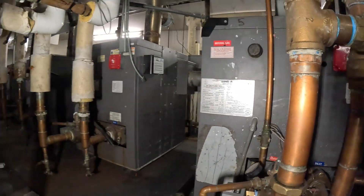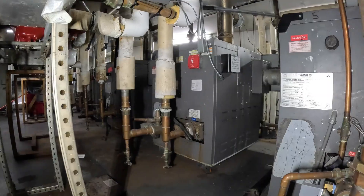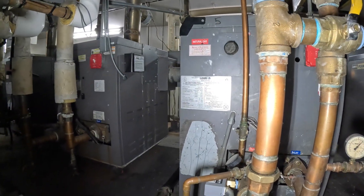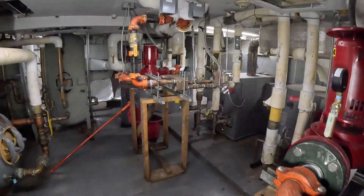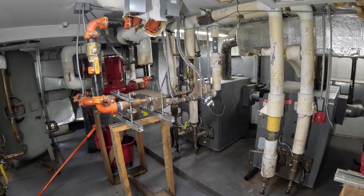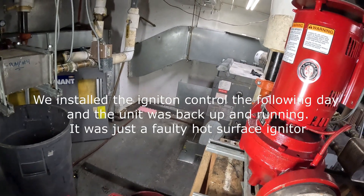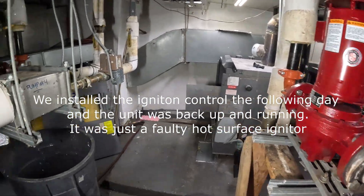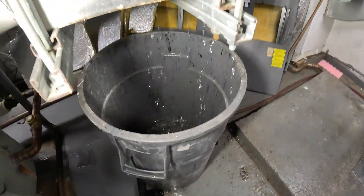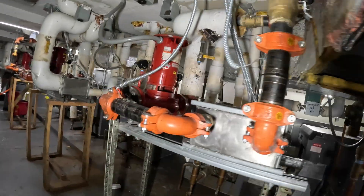They're actually getting rid of all these boilers — it looks like they're going to go with electric boilers, getting rid of gas equipment out here in New York City. For this one we had a bad ignition control — pulled it off the other one, put it in here, everything's working. The other one: the ignition control was sending 120 volts but we weren't pulling amps — bad hot surface igniter. That one has a new hot surface igniter installed and we're waiting on the ignition control part for tomorrow. For this video we got a two-for-one deal — same error code, different issues. If anyone found this video interesting or helpful please drop a like, comment, and subscribe as I come out with new videos every week.